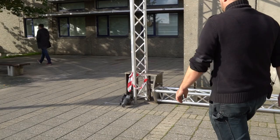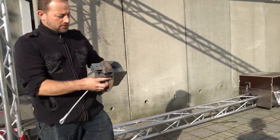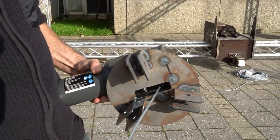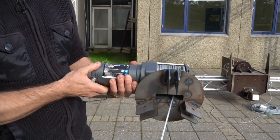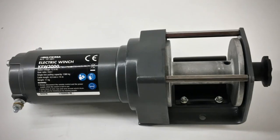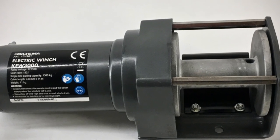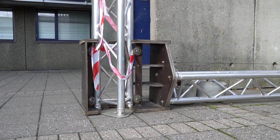So what we decided to try was to use these car winches — basically a unit you mount on the front of your truck. Each of these is battery-powered, 12 volts, and they'll pull 1700 kilos. What we need is to lift something like 75 kilos in each corner, so these seem like a good choice.